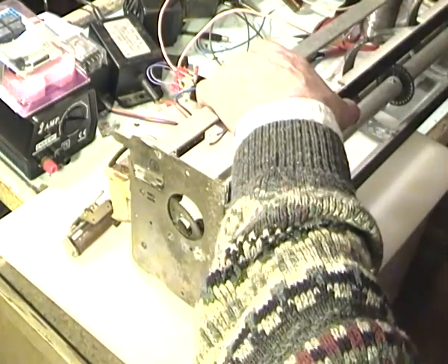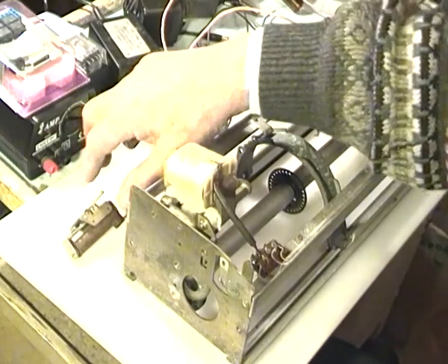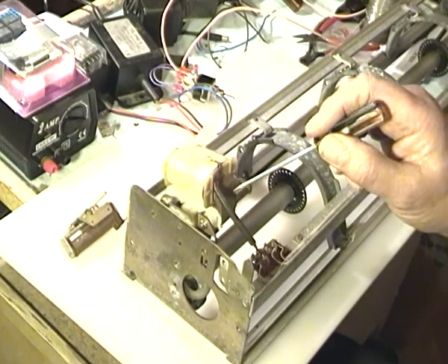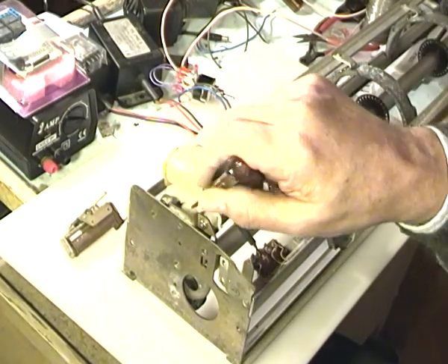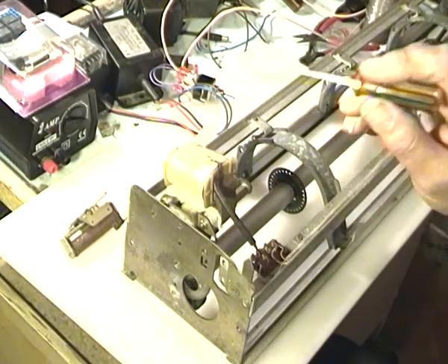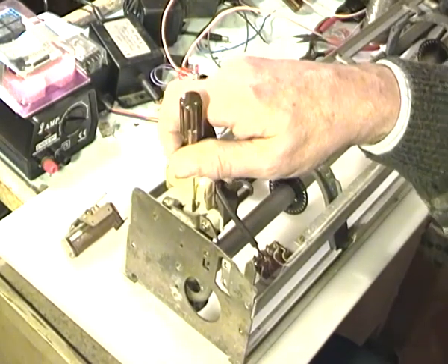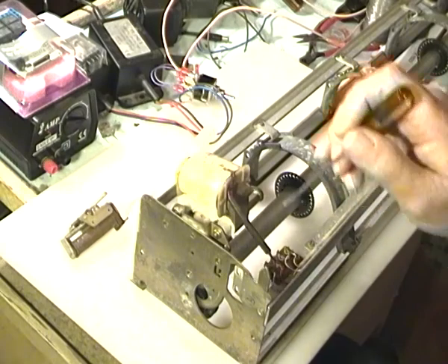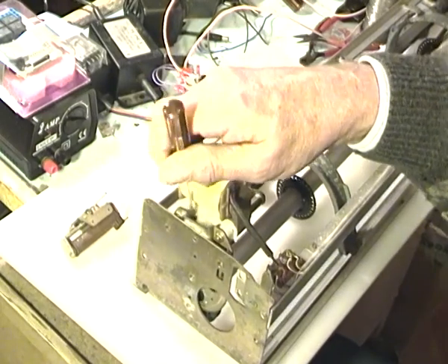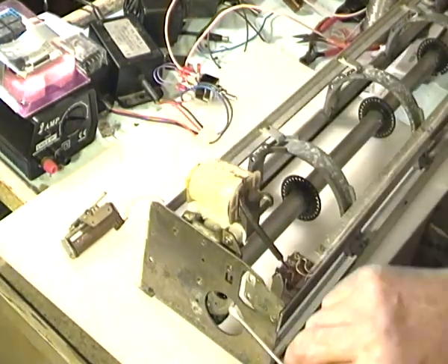The components arranged at this end are the motor and this relay. The motor consists of a large DC coil, the magnetic force from which is conducted round to the armature inside, which has six pole positions. So it takes six reversals of current to rotate the motor through 360 degrees. That single rotation of the motor does not rotate the flap drum one revolution — it is geared down through this intermediate wheel.